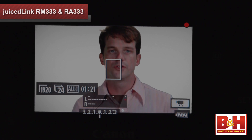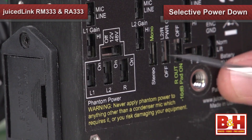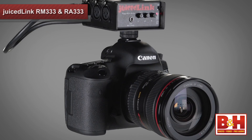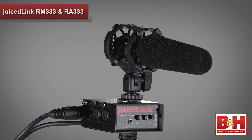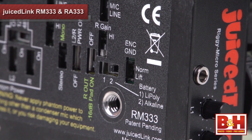When this feature is enabled, all the inputs are mixed together and sent to the left recording track of the camera. A copy of all those channels is recorded and sent to the right track of the camera at a safety level, about 16 decibels lower. That means if the audio suddenly spikes and blows out the main channel on the left, that section of audio can be retrieved from the right channel and adjusted accordingly in post. Another nice feature is called Selective Power Down, which will help you conserve battery power. With all three XLR inputs active, you'll get approximately 12 hours of battery life without phantom power, using a fresh 9-volt alkaline battery. With Selective Power Down, when you're only using one XLR input, you can power down the other two inactive preamps and increase your battery life to about 40 hours without phantom power.